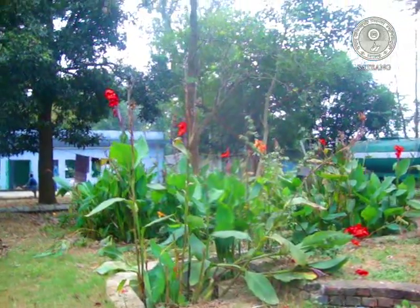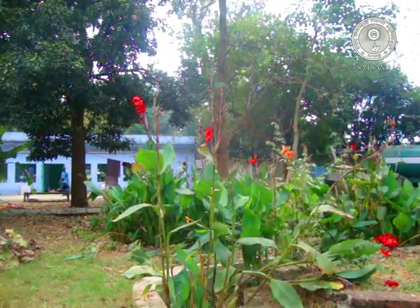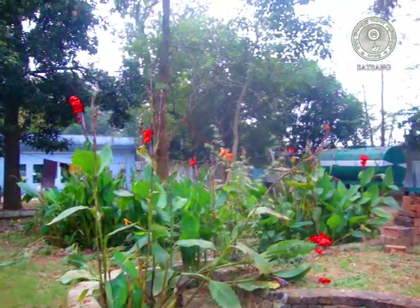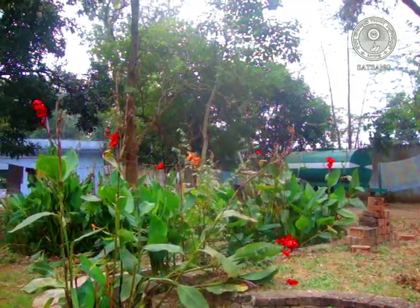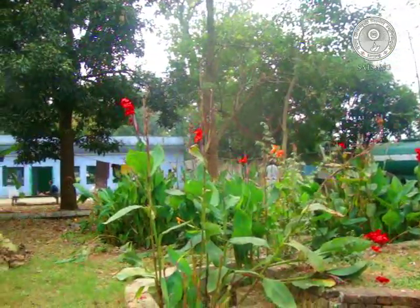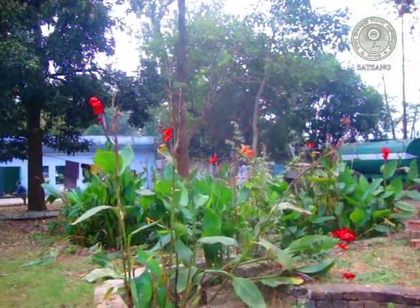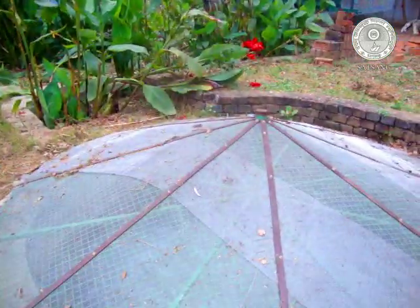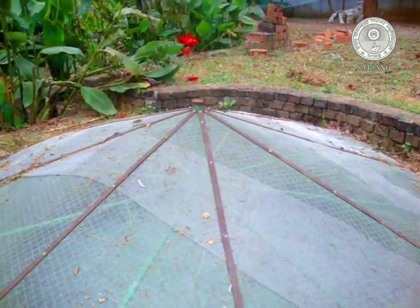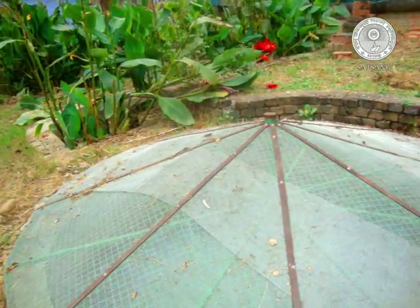You can see the complete plant filter and how the flowers are flourishing — a very good indicator that the grey water treatment is working well. We checked the BOD before and after, and it is reduced to 30 out of the initial 100, which means the treated water is excellently fit for horticulture and agriculture purposes.